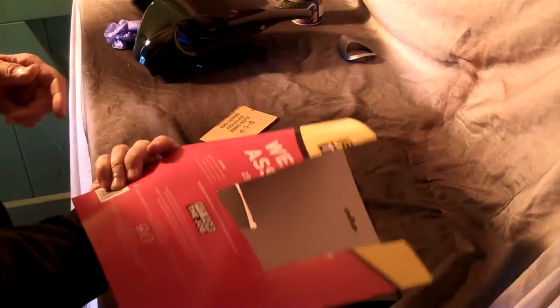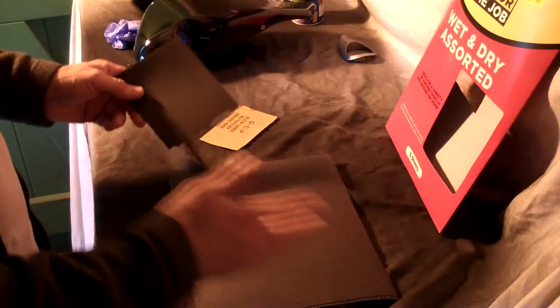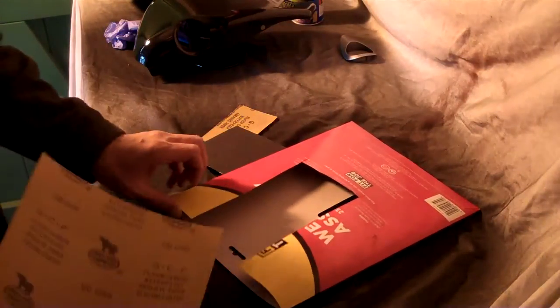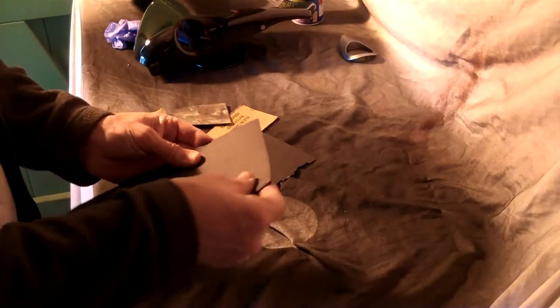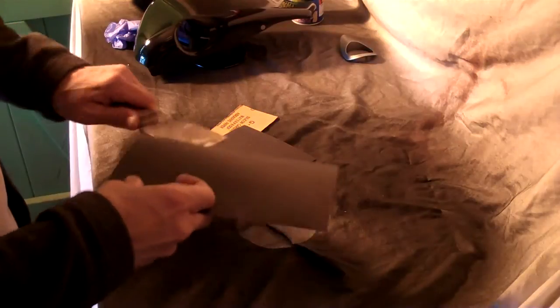The first job before any other: I need to make some fine paper. As I said previously, I bought these five sheets of wet and dry for a couple of quid — $1.99 — and they're perfectly good. The super fine 1200 grit stuff is expensive; you have to buy a pack of six or seven sheets, about four or five quid. What I've got left are these really coarse sheets, which I'm not going to use. So I'm going to do this little trick again — it's ever so easy. You just need a reasonably sharp edge and rub the paper face to face, use it against itself and it'll make fine paper. It'll just knock all the grit out and give you something you can use to get a nice flat finish.